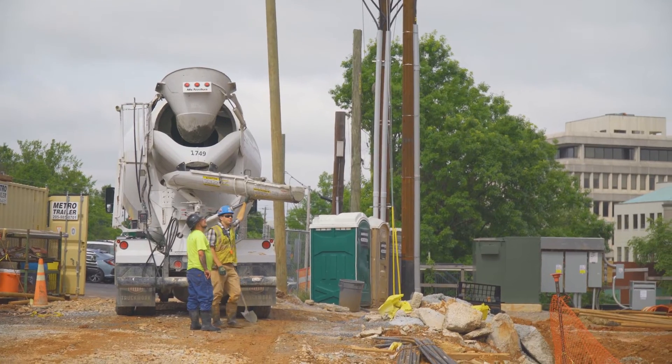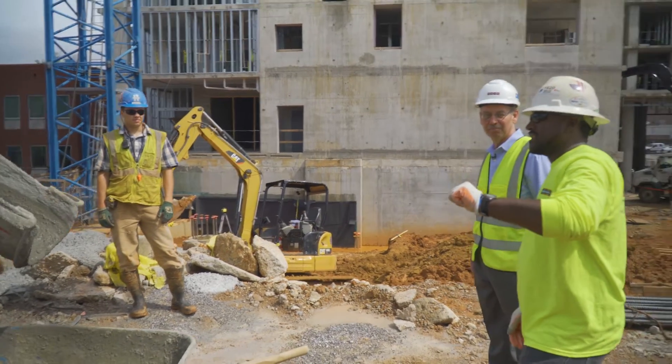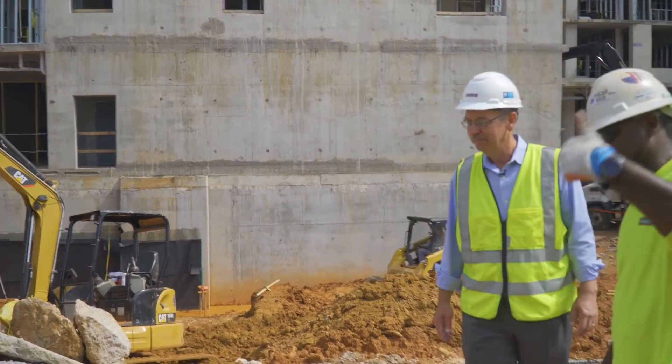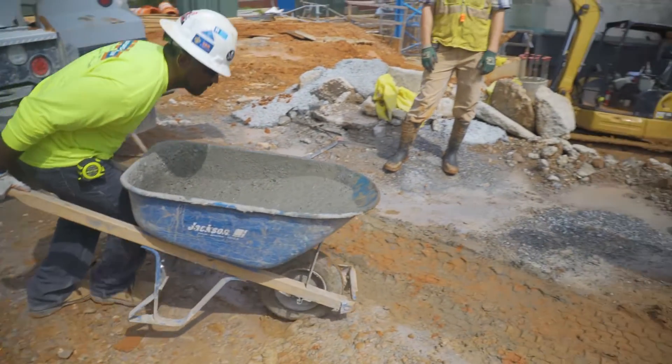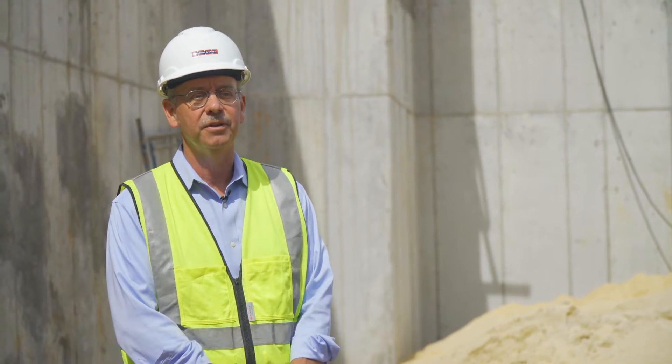Once we have the foundations in, we're satisfied that they meet the design parameters, and that's when testing, verification, and special inspection part of our work starts over. This morning Manny is going to make cylinders for the concrete columns that go from the 11th to the 12th floor, and after each floor is placed we also verify that the post-tensioning cables are stressed appropriately.